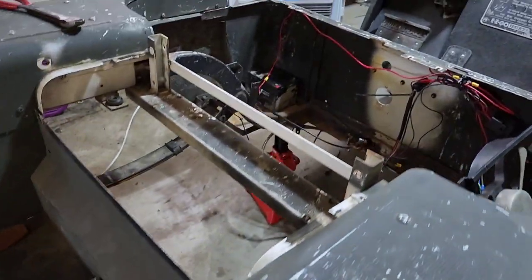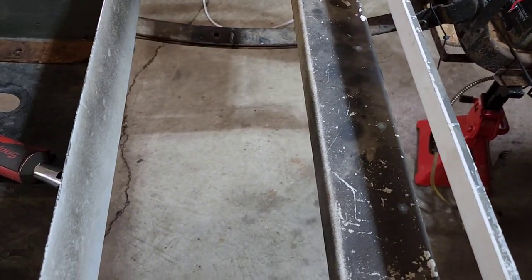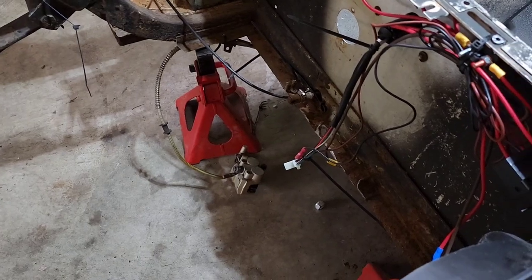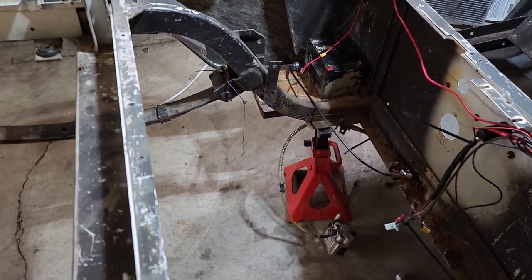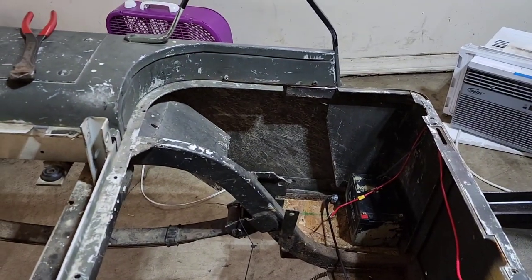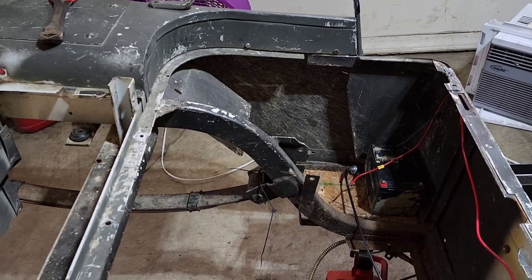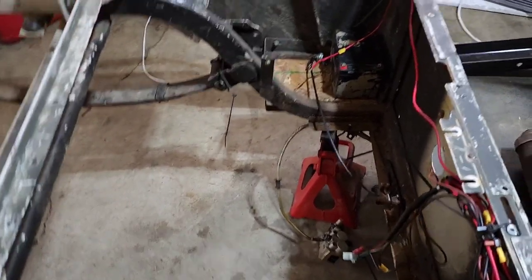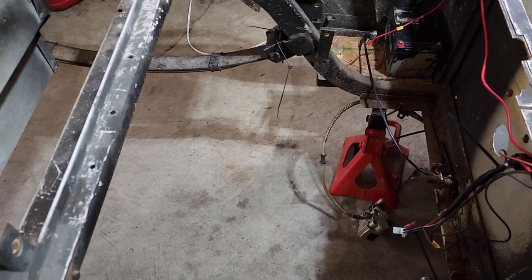And then we can put this back under the cart and figure out what I'm going to need to do up here, because that'll tell me how far back it's going to be. And then we'll be able to figure out what we're going to do up here. That'll take care of my axle issue. And then all I have left to do is figure out the shifter issue, which will be fine. I mean, I made the shifter, so I'm pretty sure I can modify it. And then that should fix our whole problem of picking the front end up when we turn with three people.